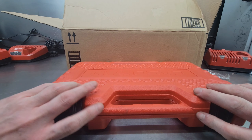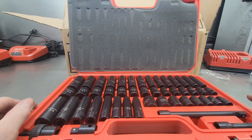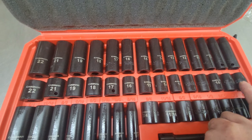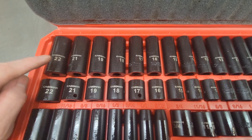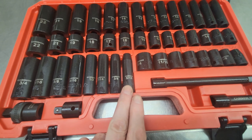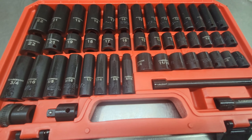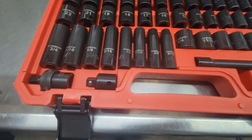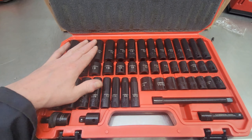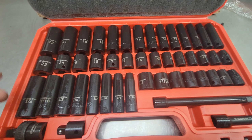Next I wanted to add another ratchet to the setup. I've always been partial to swivel-headed ratchets so I thought I'd try this one from Olsa Tools, part number 1249. It's a 90-tooth design. It seems easy to get the next tooth and it's nice and fine, so you should always be able to grab that next tooth in a tough spot. The selector is raised a little bit, so if you're wearing gloves it makes it that much easier to change direction. The head is fairly tight but that's adjustable — you can back it off or tighten it up depending on your needs.